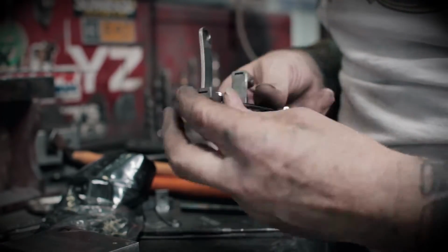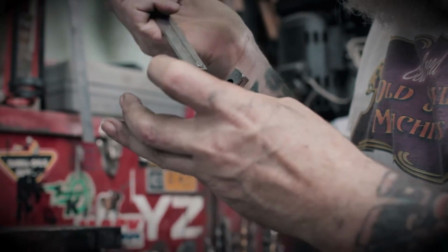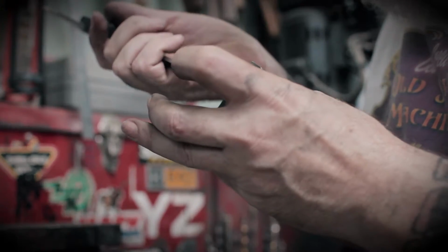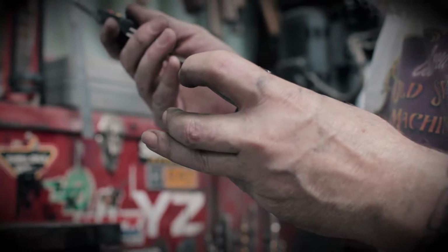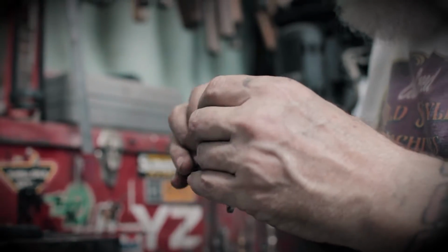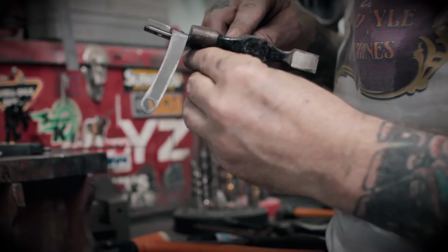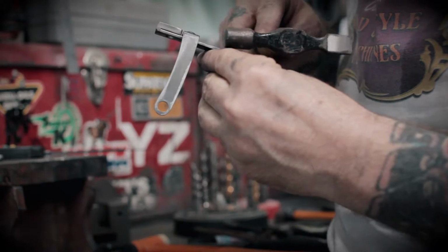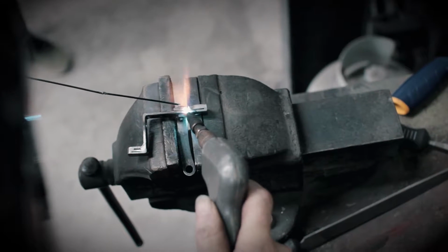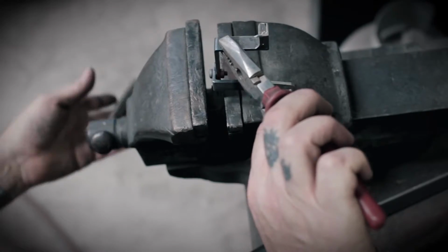In some cases, the sidearm's position in relation to the frame and the tube can make a machine run very differently. It's almost like you're creating two separate machines. So for repeatability, Colin builds these pieces separately so that he can do fine adjustments, weld it into place, and then do extra adjustments if he needs to. Sometimes force is necessary, but for Colin, he prefers to use heat and finesse to get the outcome that he wants.